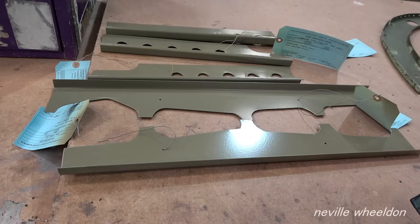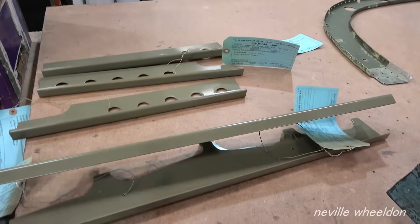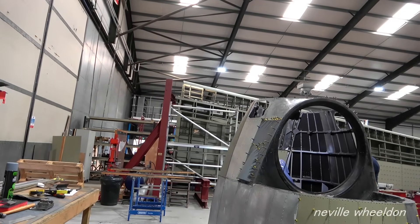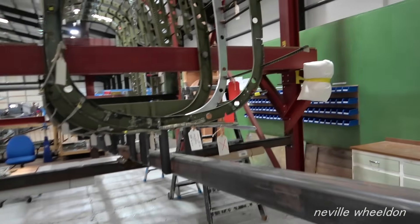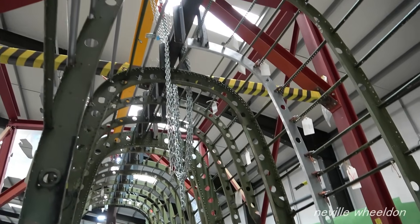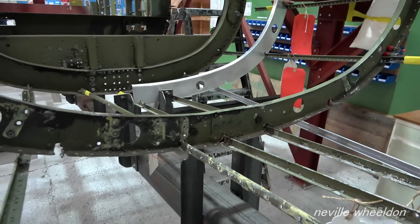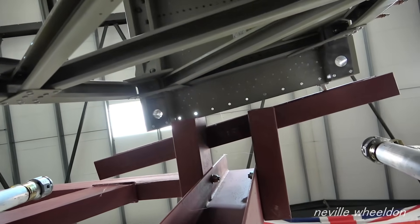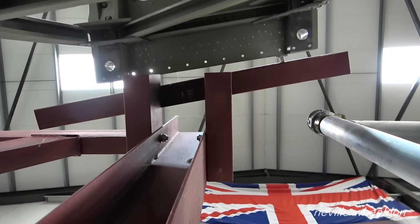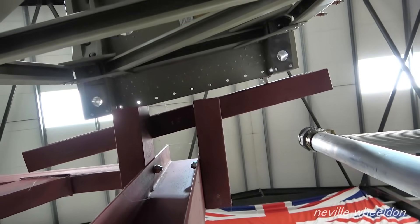Dave's on holiday this week. These are some of the intercostals and frames for the floor of the fuselage. He was working on these last week and now these are back from painting. Dave has made one of the formers and got the starboard side fitted. They'll have this one to do when he comes back. This shot was taken looking up at the side of rib 22 towards the front spar. The two holes either side of the front spar, which pass through the boom and web of the spar, are where the bolts pass through to hold the wing to the centre wing section.